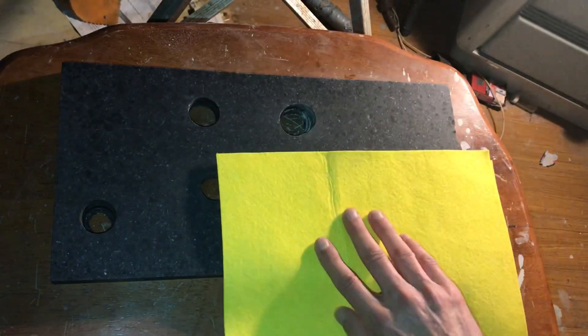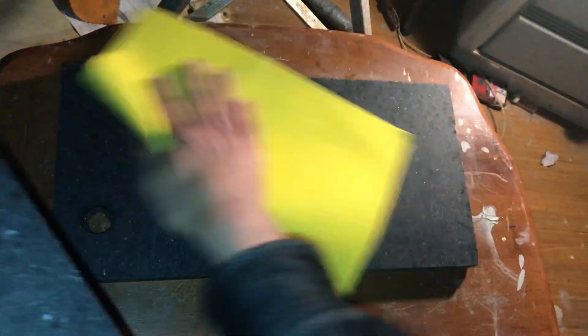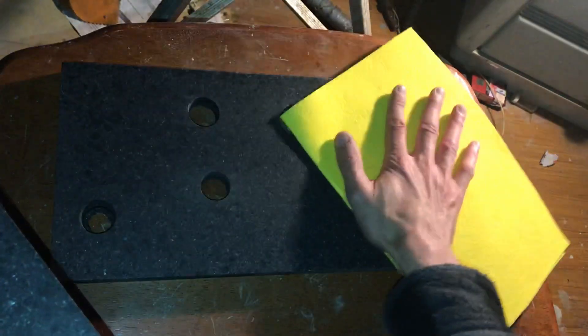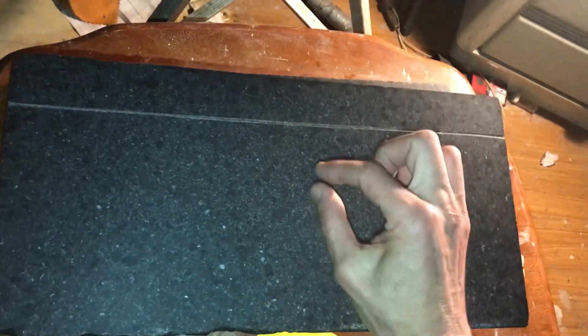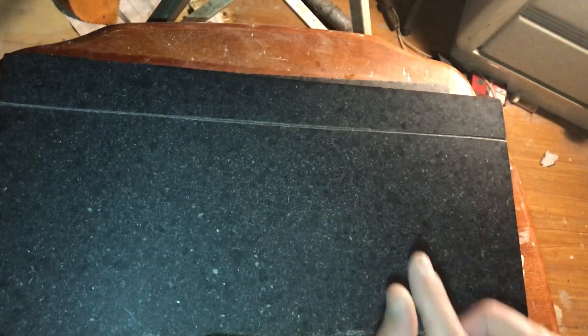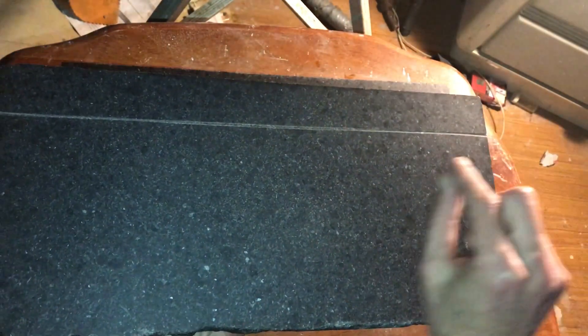Just with sand and water — and I'm not even cleaning it with alcohol like the professionals do. There's no oil, no tricks. If you look up 'floating a granite surface plate,' these things are precise. By precise I mean a couple of microns across the entire surface — not surface roughness, but actually flat. On one spot, maybe a micron or less; across the whole surface, a few microns of difference in true flatness.